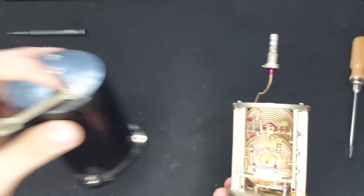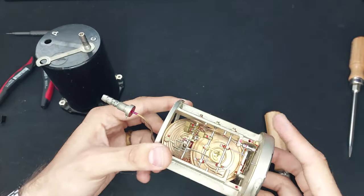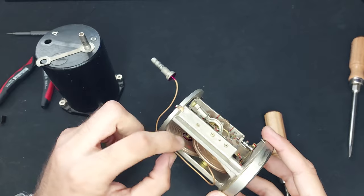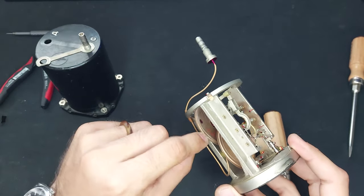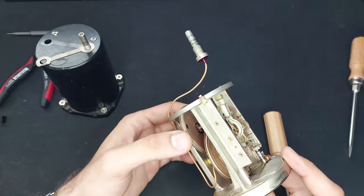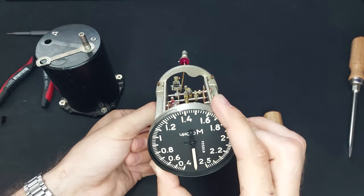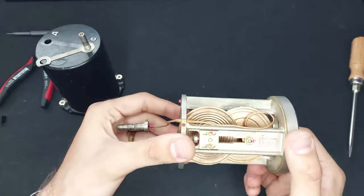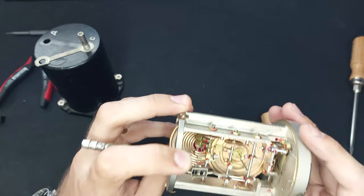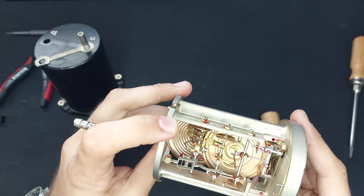The other port here, I think it's actually just there in order to serve as the intake for an ambient pressure, because of course, this can't be under a vacuum, and you need to have a relative pressure between the inside of the diaphragm and the outside. And for that to happen, you have to have a very well-known pressure, for example, inside the cockpit. So this might be actually tied to the oxygen supply for the pilot, or through a regulator or something like that. So yeah, very interesting. And those diaphragms look like they're made from, I'd say, copper or brass or something like that. They look a lot less gold in real life than they do on camera. So yeah, I don't know.